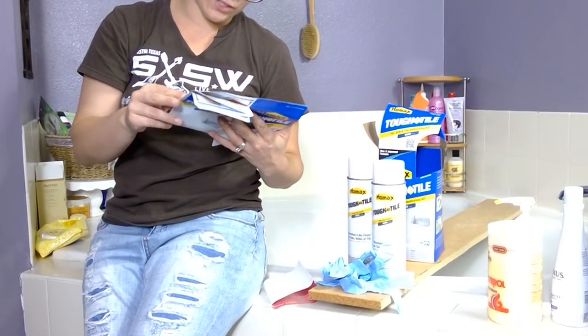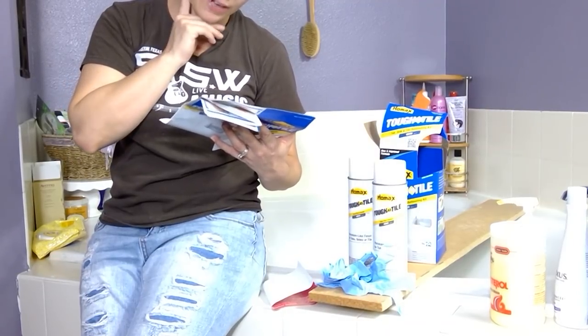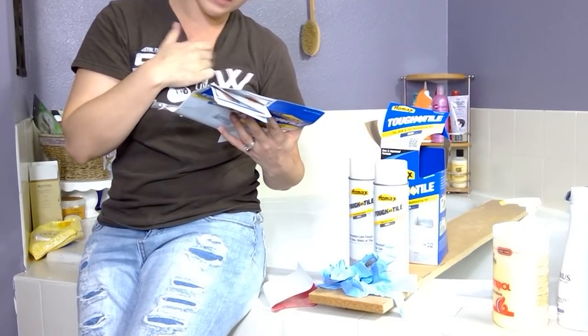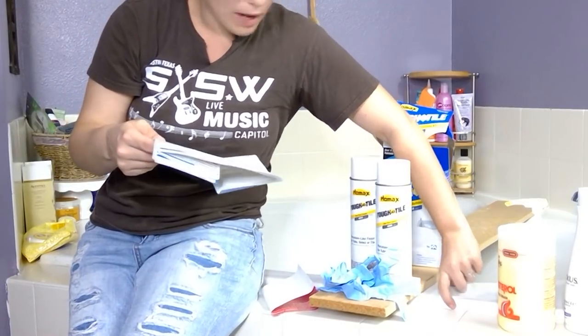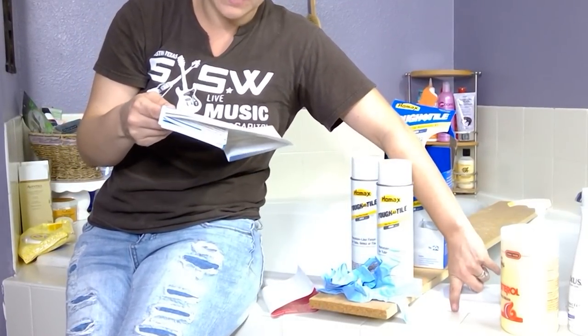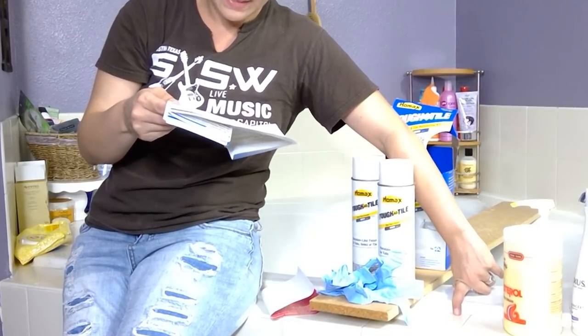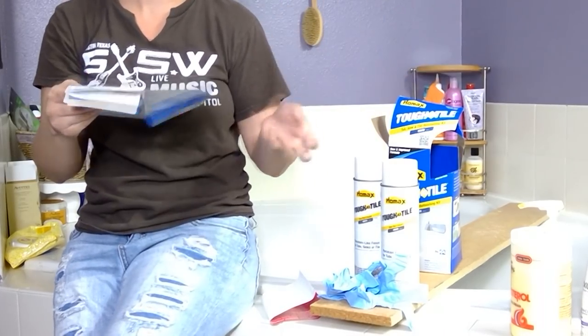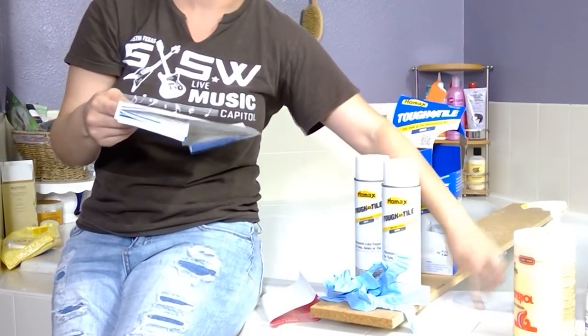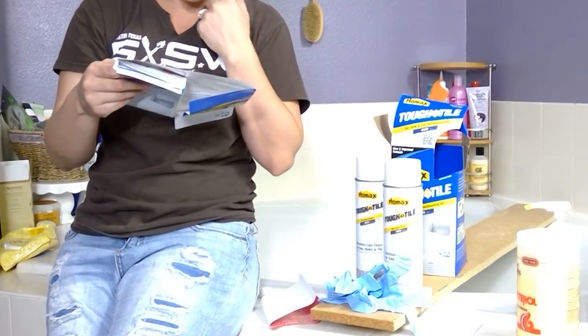You are going to clean and prep the surface. You're going to repair any existing cracks or chips. You want to remove all existing caulk, which is really important. So I'm going to go ahead and get a scraper and take all of that up, which is going to take some time. Then you're going to scrub the areas with isopropyl alcohol or a non-oily solvent. Alcohol is perfect because it's a drying agent — as soon as you put it on, it will evaporate and dry up the area. Good to know, it's a dehydrator.